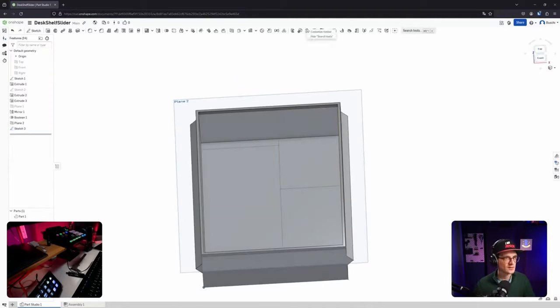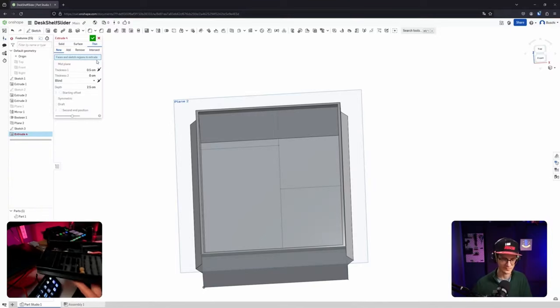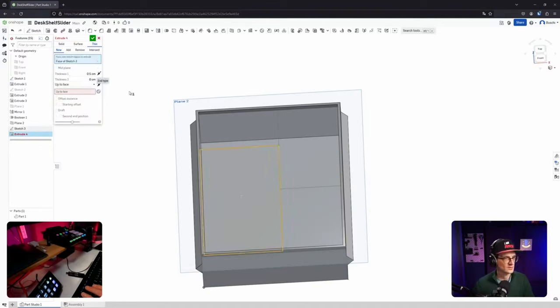Now, I was talking about this earlier, the gusset. Maybe that's probably still right, but I think I will just go with thin extrude for now, because it's a bit easier. Thin, thickness, I guess a millimeter or a bit more even, 1.5. I printed that in PLA, and 1.5 in PLA is quite tough and sturdy. So you can bend it still, but not that it really goes anywhere. So down to fin. Why is it complaining?